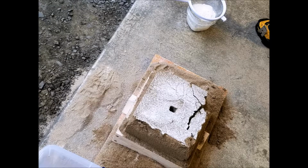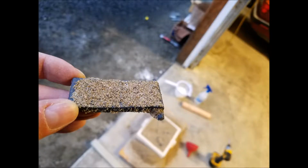Unfortunately, the mold fell apart at every attempt, and the sand stuck to everything except itself, making it impossible to get a good impression. I decided to fire up the foundry anyway and make some aluminum ingots from cans and scrap aluminum I had with me to make the casting process faster and easier next time.